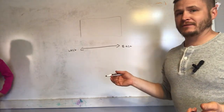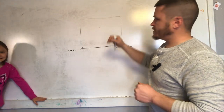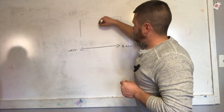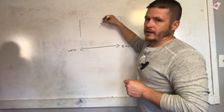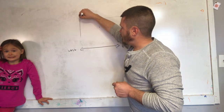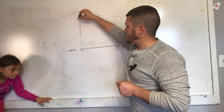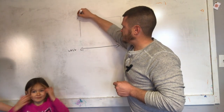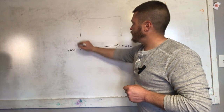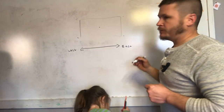I'm going to take a laser — it's a picture-frame laser level kind of thing — and I'm going to set it in the middle. It shoots out a laser in one direction. I'll put it on a box or something like that and it'll shoot the laser out to each post. I'll mark that post wherever the laser hits, then turn it, mark the next post, turn it again, mark the third post, then turn it again and mark the fourth post.